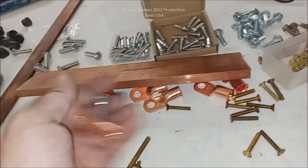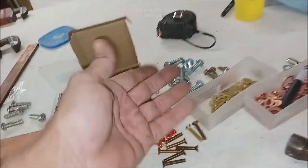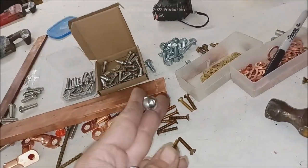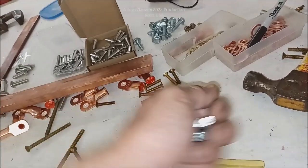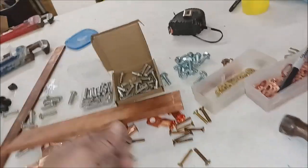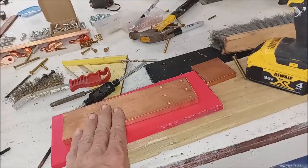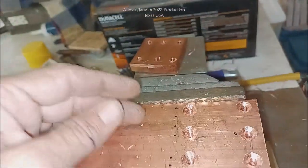We have a pair of three-oughts that'll run on those. Then this comes off the 60-amp ones. These bolts here may be used but they're a little too magnetic for my liking, so I went ahead and got these which are 304 stainless - plus it's a neater look, and you can reach the center of it with less risk of a wrench bumping something. We also have these self-tapper style bolts that we'll be using for these controllers. I'll put a list of these parts below - this is e-made metal and believe it or not it was cheaper to get off eBay than most dealers. This is 110 copper and it's pretty impressive stuff.